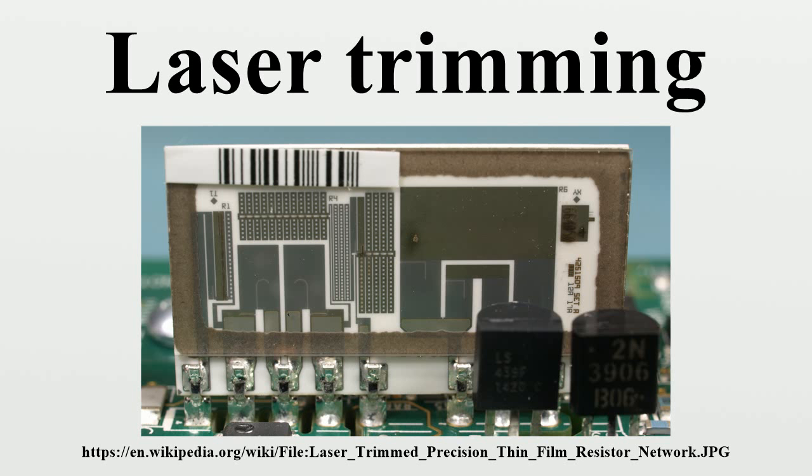Function mode: the LTCC is mounted in the contact unit. From the opposite side, a rigid probe contacts the circuit. From the top side, the chamber is pressurized to 1 to 4 bars, with a controlled exhaust port to achieve airflow through the chamber. As the resistance material is vaporized, the waste particles are removed in the airflow.